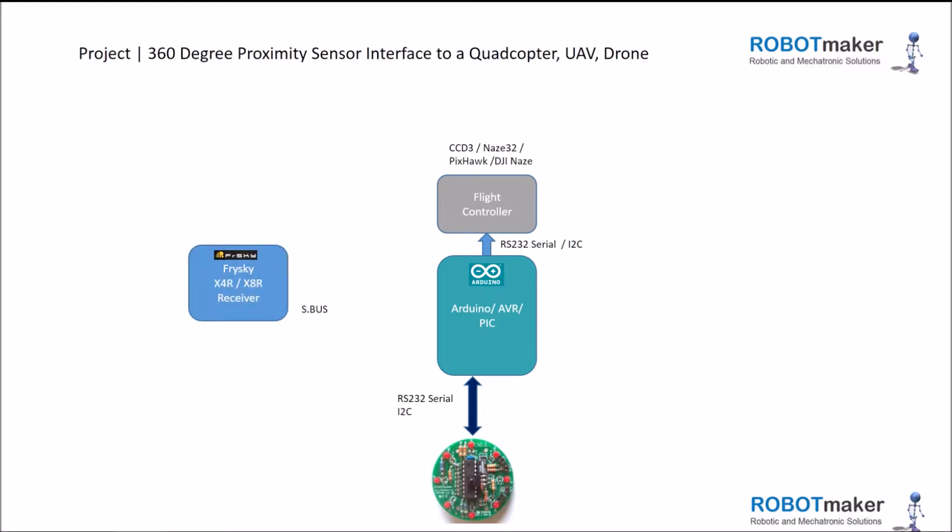There are a few ways we believe we can do this. One approach is to analyze the SBUS data coming from the FRSky X4R receiver, going to the radio controller and possibly other devices such as a gimbal. So the proof of concept is to get the Arduino to read the data coming from the X4R, merge that together with the serial data from the infrared control unit, and then pass that data back to the flight controller.